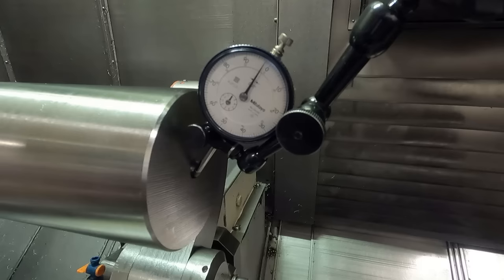This is the one up here. I'll jog this back. This one up here on the front is for the steady rest, which if I blow it off a little bit. And the one in the back is for the tailstock body, actually. The quill is run by a separate deal. But you can actually do this automatically. You can put it in the program to do all that and move it back and forth, but I generally don't do that when I'm doing things like this, because I want to make sure that I have things right and there's no shavings under the rollers and everything. But it can be done automatically in a program. You can go down there, pick up the tail center's body and bring it forward, clamp it, and then extend the quill into the part. And I've done that very rarely.